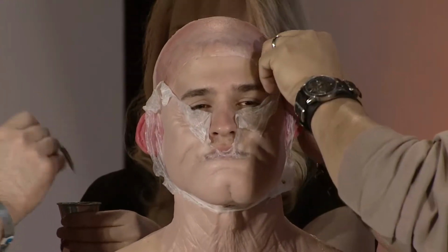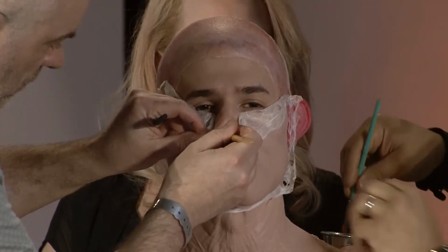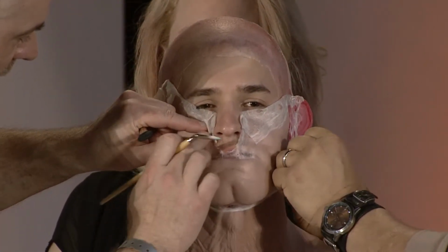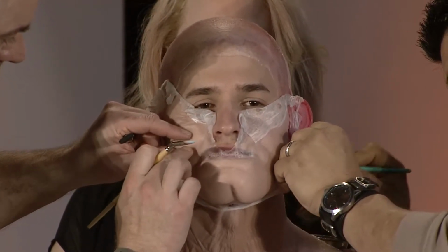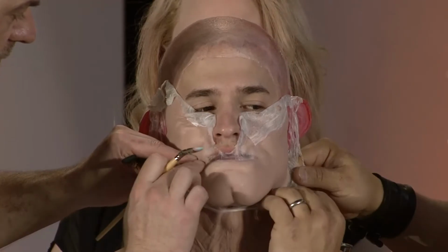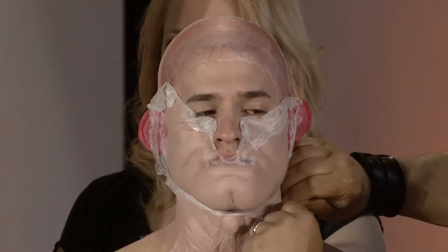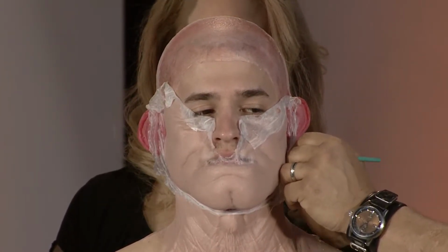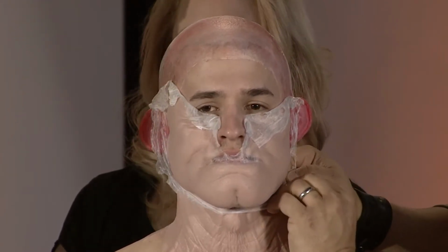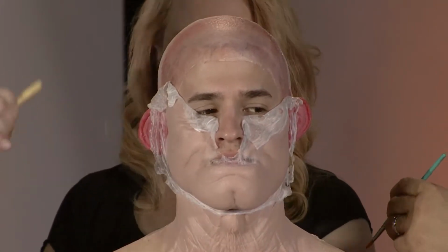Another good trick we do is, because the Vaseline can make a very shiny surface, you have to really thin it out and get as little in there as possible, but you tend to have a bit of a sheen still. So to avoid your pieces being super shiny, I take a bit of talcum powder and get the mold. Once I've finished doing all the Vaseline and everything's dry, I blow a puff of air of powder, and it coats the surface, so it pre-powders the inside of the mold really lightly. Then airbrush on top of that, and your pieces come out mattified.